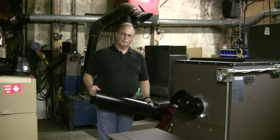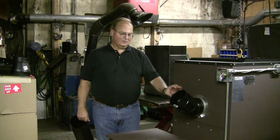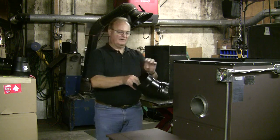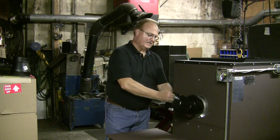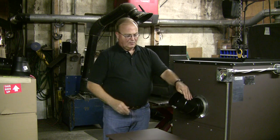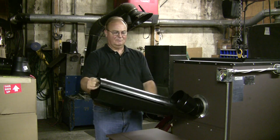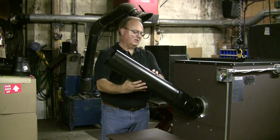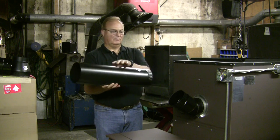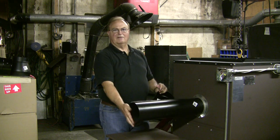The first thing we're going to go through is the chimney hookup. What's unique about this is we use relatively low draft, so it's important that we maintain no more than one 90-degree bend. You'll notice I have this set at roughly 45 degrees — these are adjustable. The small end always goes into the previous one; draft will keep that sealed up. We like to have the chimney pipe going at roughly a 45-degree angle because smoke and heat don't like to move horizontally. Horizontal is really bad for a wood furnace — one of the worst things you could do would be to put a horizontal run right at the furnace.